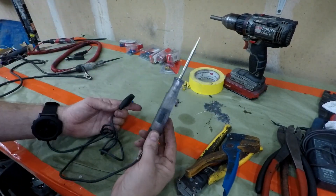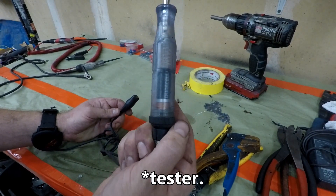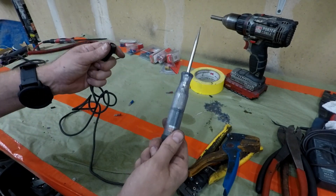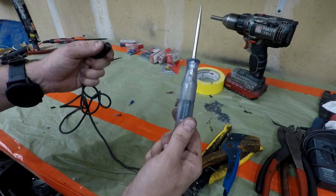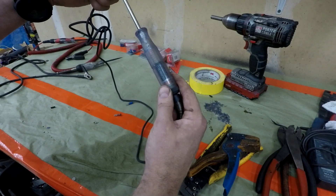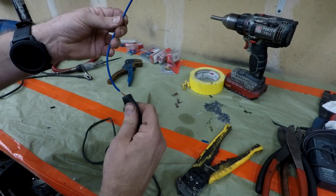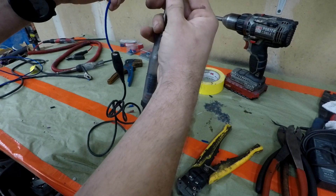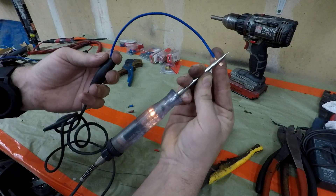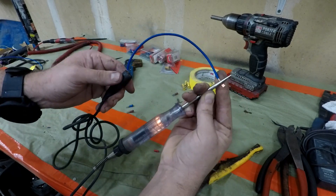Not to be confused with continuity meters. You can tell what a continuity meter is because it's going to have a battery in it. All a continuity meter does is make sure there is an uninterrupted connection. If I put this thing to its end, you'll see it lights up. If I take this piece of wire, clip one end into it and then touch the other end, it lights up - telling me there's good continuity, an uninterrupted connection in this wire.